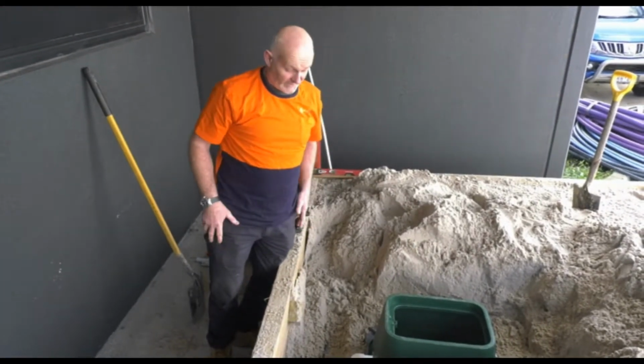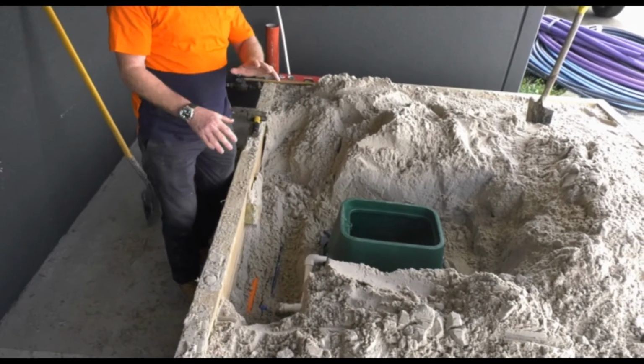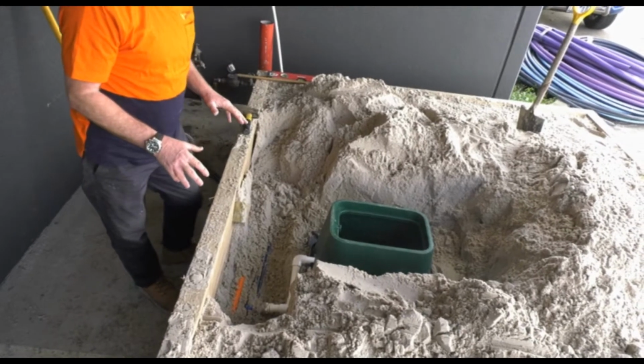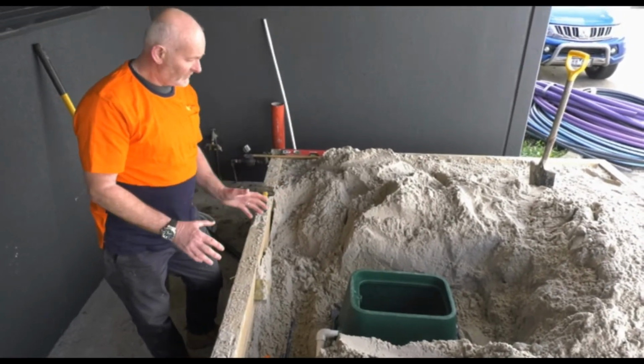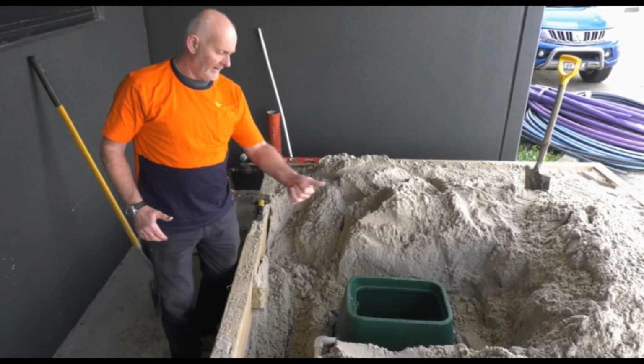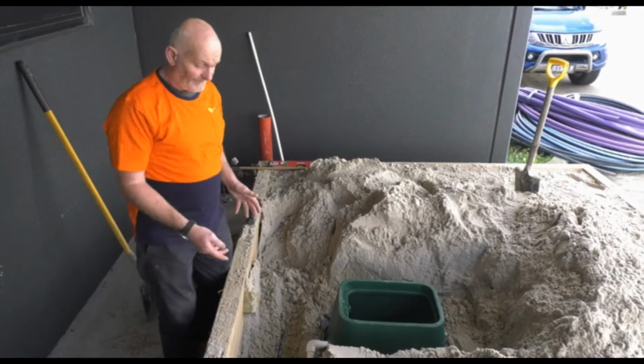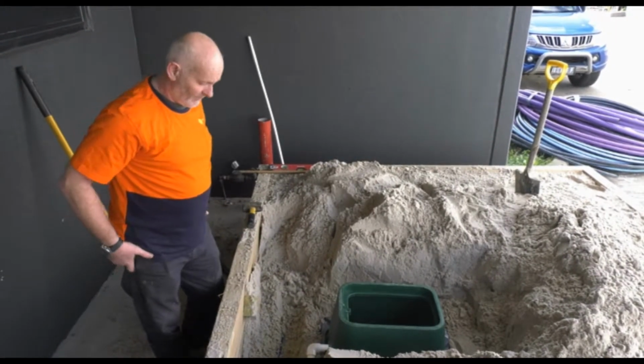That's in another one of our videos. But as you can see, by using the two 90 mm elbows, we've made a bit of an articulated riser with the PVC, and we can move that up and down to get our level straight through there. As I say, normally we come straight up and in, but depending on where the mains are, and sometimes we're using mains we haven't put in, this is how we get over this problem.